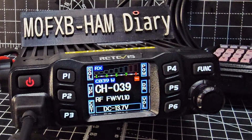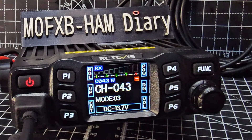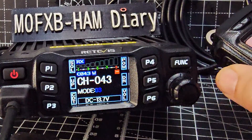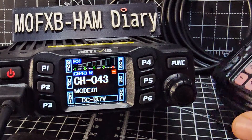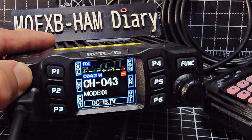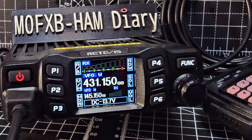It says test mode. Now turn to channel 43 — it says mode. With the PTT button, hold it down and change the mode. At the moment we're on number three in blue, so let's put it to number one, let go, and then reboot the radio. Just power it off, power it back on, and you will now stay in whichever mode you selected.